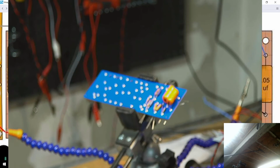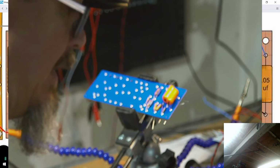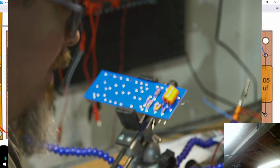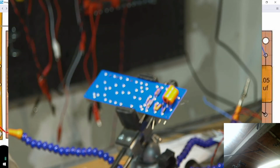And then I need a jumper from that same position over to ground. So they're just connecting ground. To be nice for people looking at this, since my purple ones were just jumpers for signal wire, this is a jumper to ground, so I will make it black. I do like to color code things in ways that will make logical sense to someone trying to fix them later. They may not know what colors I like to use, but they'll at least see a color that looks like black and say, oh, that might be a ground, and sure enough, it will be in this case.